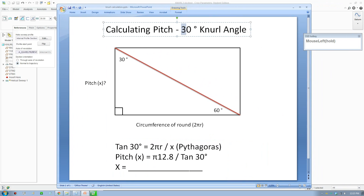So basically to calculate a 30 degree angle cut - this is the elliptical line here and this is the flattened version of the rod. So basically if you cut it and spread it out, from there to there is one pitch. We're gonna use Pythagoras to determine the pitch. We want to figure out how to do a 30 degree angle crossing down, and we know the circumference which is 2 pi r. My radius is 6.4.